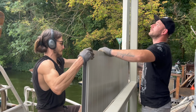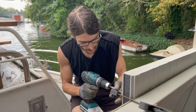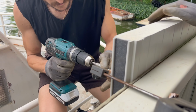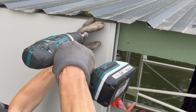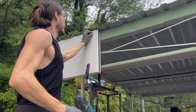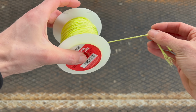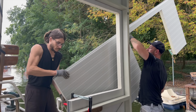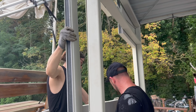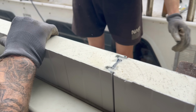However, spoiler alert, all the cutting we did initially turned out to be superfluous because I made a mistake that led us to recut almost all sides of the doors and windows. A blunder I will discuss in a future video. I aimed for precise alignment of the upper line for all the doors and windows on the side using a thread as a guide. Looking back, using a proper Mason's lacing cord, which we used during the recutting process later on, would have been a smarter choice. Nevertheless, that was the technique we chose, and it's how we constructed the entire cabin walls.